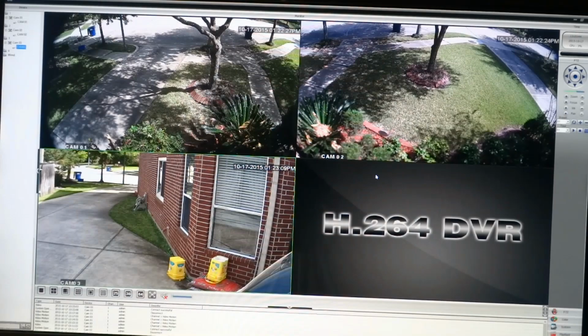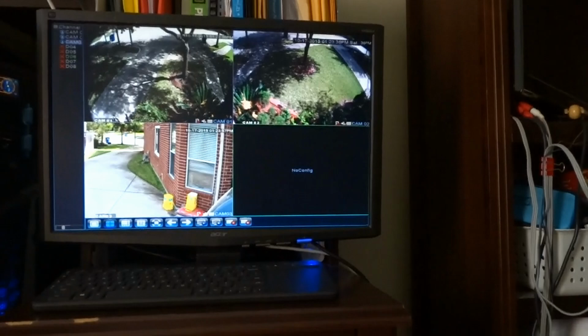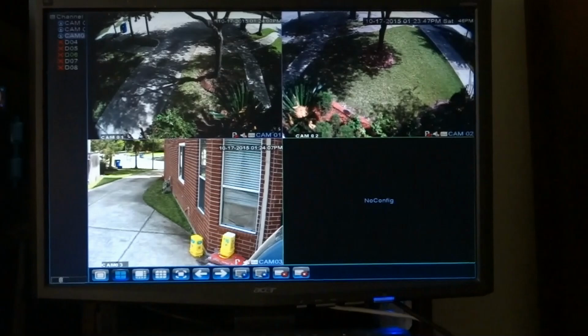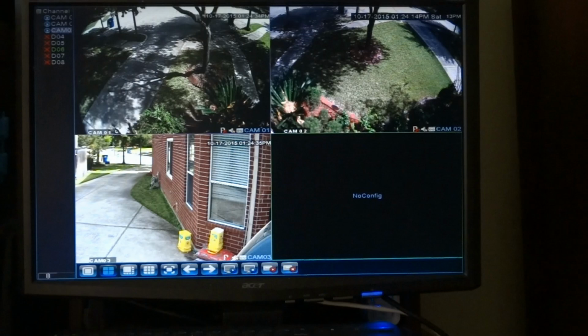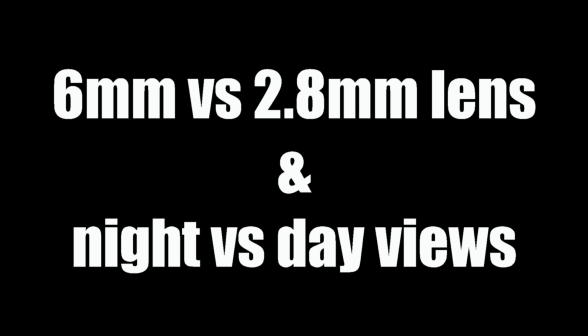It's pretty simple. You can see over here, this is what my NVR looks like. It's very similar. There's my NVR. It looks very similar. I have the camera set up the same way. I'm using the NVR so I can do live full-time video recording and go back and replay any particular minute from any camera that I want. And at the same time, I'm using the individual cameras using the motion detection feature to send me an email with a snapshot picture of any movement that it finds. And I'll show you a few examples of that.